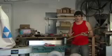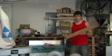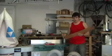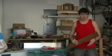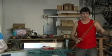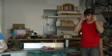The first thing I have to do, even before starting talking about dovetails, is how to prepare the stock. You want to make sure the stock is perfect. This edge has to be perfectly straight, and just to make sure, I'm going to push it through the jointer, and then I'm going to cut the 4 pieces at the table saw. As always, you have to remember to wear ear protection and eye protection.